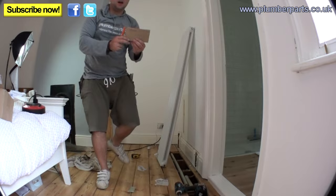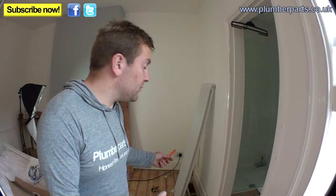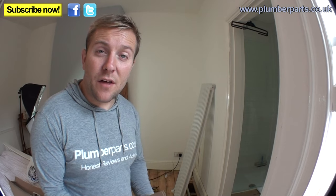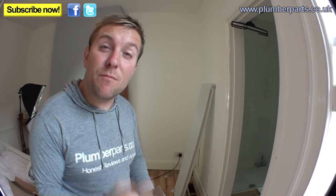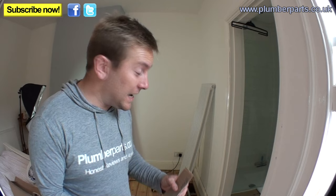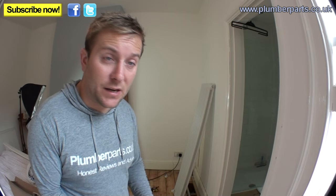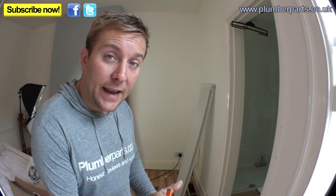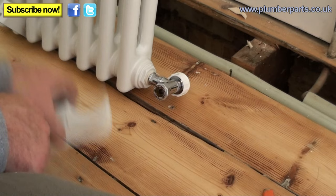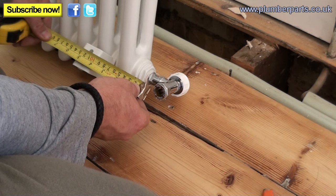So the bracket width equals 21.5 and height equals 143.2. Much in the same way as the towel rail video, you need to decide where you want to hang the radiator. Because we already know our bracket width, we can define the center of the radiator on the wall, divide that by two, and measure out from that — then we know where the widths of our brackets are going to be. When it comes to the height of the radiator, I always start from the bottom. I want my radiator to be 20 centimeters off the floor — you know that your bracket is going to be roughly about a centimeter and a half above the bottom of the radiator, so you measure up 21.5 centimeters. Because we've already got a pipe here, we're going to mock up where the radiator valve is by popping that in the side of the radiator. Then I know how far the valve has to be away from the first bracket — measuring over from the center of the pipe to the center of the bracket gives a measurement of 11.2 centimeters.